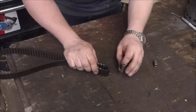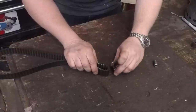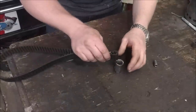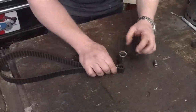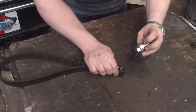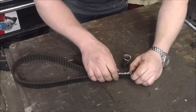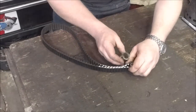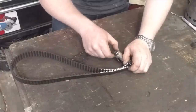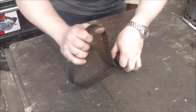We've got this shortened socket piece, and the reason why I didn't just use a regular short socket to begin with is they're a little too short, and a lot of times they have a fair amount of obstruction in there where the spark plug socket is pretty clean all the way through. So this slides down inside there, and then this little 8mm socket — this is a 13/16 spark plug socket — will slide inside there and retain it from ever being pulled out. Then it's going to wrap around the outside as you rotate this with your socket, and being a spark plug socket you can actually put a wrench on it, which is nice. As it rotates around, it'll get down and grip on whatever you need.